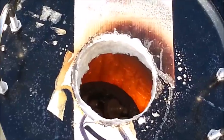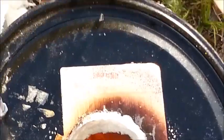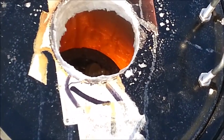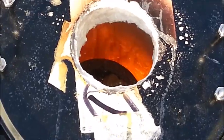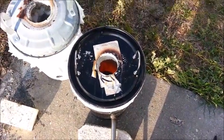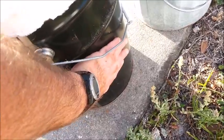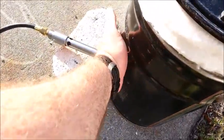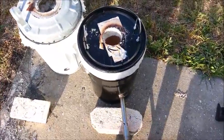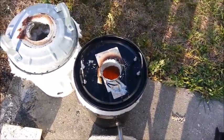It's been about five minutes now — you can see how bright it is, glowing in there. The burner is blowing around that way and we've got a nice swirl going on around the crucible — a beautiful little tornado of fire surrounding the crucible. The back side is glowing the brightest because that's where the burner is pointing. But over on the other side it's barely warm. Five minutes in and it's glowing bright orange on the inside on one side and barely warm on the other. I absolutely love that ceramic fiber insulation — that is great stuff.